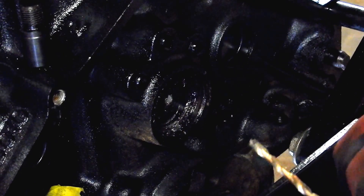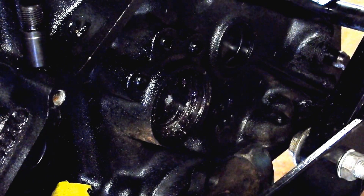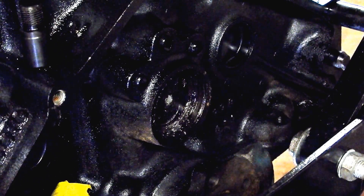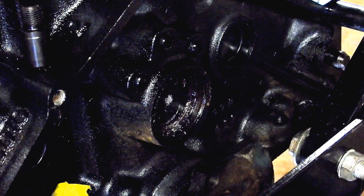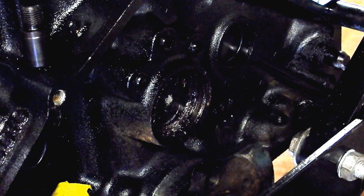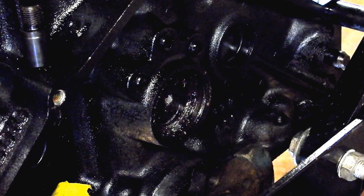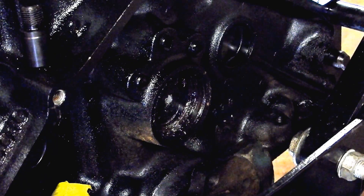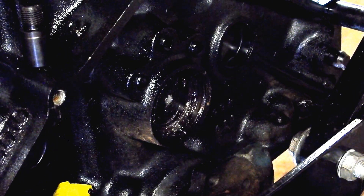That bit's not quite long enough to even drill into it, so let me get a little more bit here. I wasn't thinking — I need one inch from the angle plate, and that's set in a lot. Since I have a bottom tap, I probably only need about a three-quarter inch deep hole. I think that one inch is if you don't have a bottom tap, to give your tap room.